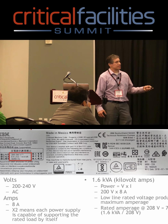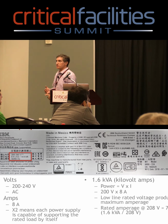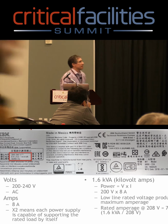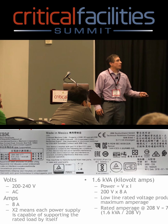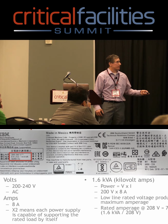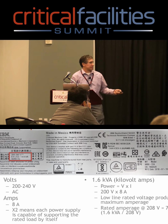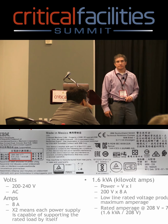You'll see 50/60 hertz, it's just the normal frequency. Around the frequency, the range is plus and minus 3 hertz. So if you're at 60 hertz in the US, it's 57 to 63 hertz. And the last thing, if you ever want to know, for example, if you're operating at 208, what the rating of that product would be, it's pretty simple. It's rearranging this equation. Take the power, divide by the voltage, and you get the amperage. So in this case, it's 1.6 kVA or 1600 VA divided by 208 gives you 7.7 amps.